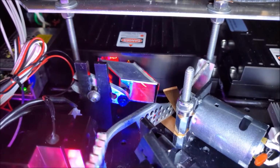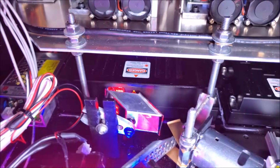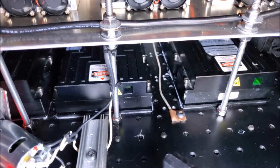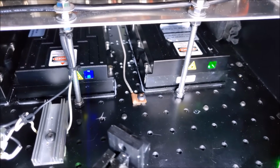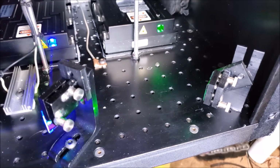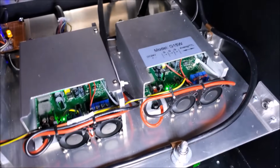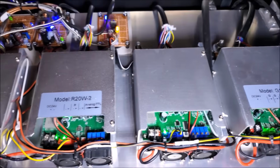They custom mount an optical assembly for the red. That went together really well. Yeah. The blue and the green laser heads. My little sensor for the temperature between those two. The dichroic mounts for the optic. So dichroic filter on this one, first surface mirror on this one. The plate with all the laser drivers on it. That looks good.